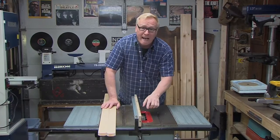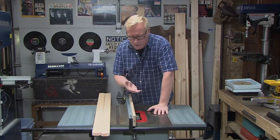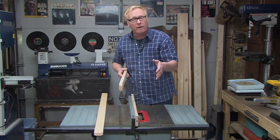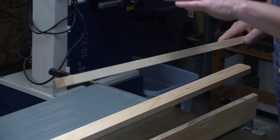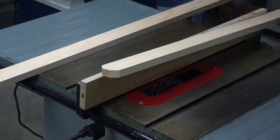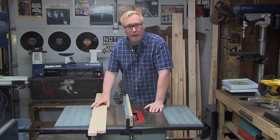I've put in my stacked dado blades, stacked to create three-quarters of an inch wide — that's the width of the dado. I've raised it to three-eighths of an inch, basically splitting the thickness of our three-quarter-inch boards. You could go a little shallower, but if you go too shallow it won't support the foot of the stilt; if you go too deep, you lose strength in the shaft. I'm going to push the board along until I reach the end of the saw fence — I just want the dado long enough to house that foot part properly and securely.